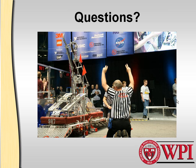So that was a fire hose on a few things there. The take-homes were to understand that skid steering is a robust way of driving. Do not think you're backing off on capability by going to a skid-steered robot. It will be the most stable robot you can build. It will be the quickest you can get on the ground, which is important. And with the right control of the center of gravity and the virtual turning center, you can make it into an incredibly good handling robot.